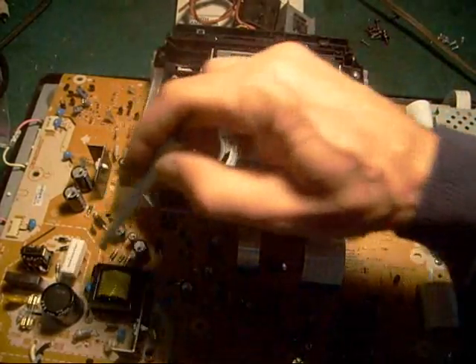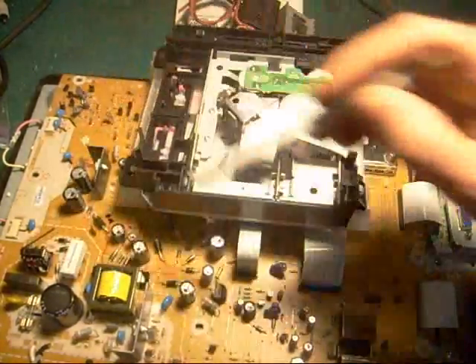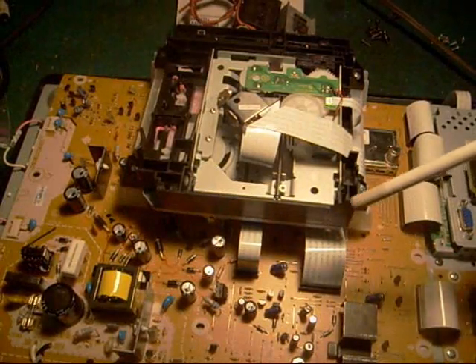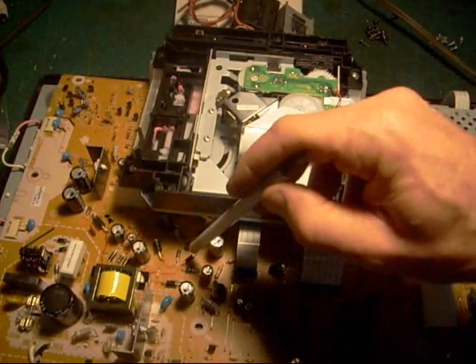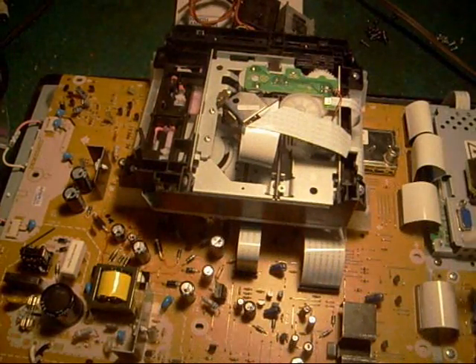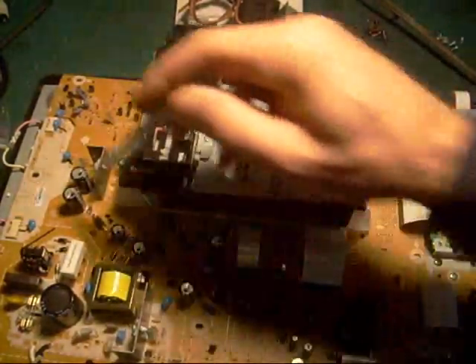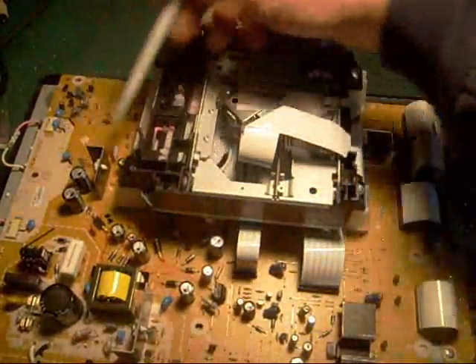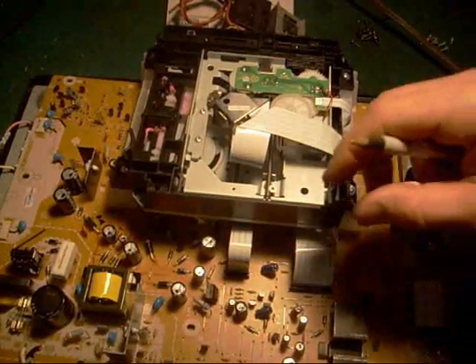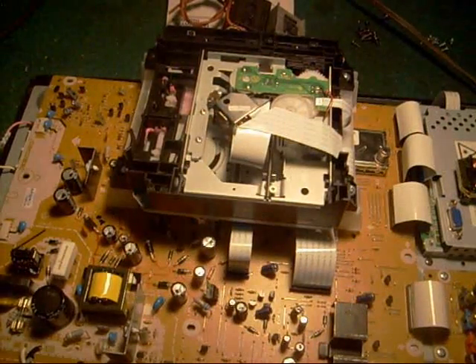Keep in mind you have many voltage outputs coming from the switching power supply here, going through these diodes and then filling up these capacitors. I checked each diode, figuring one would probably be shorted, and it wasn't. None of them were shorted, and I couldn't find any short circuits across these caps here either. So I figured there was another component somewhere in the set that had gone bad — a parasite drawing power away from the other circuits.